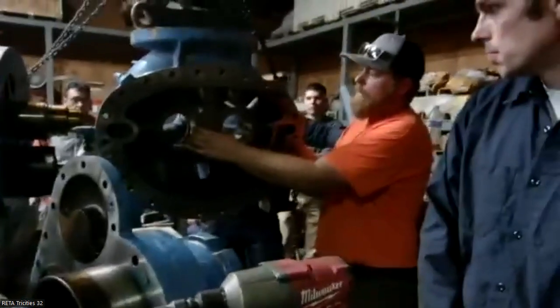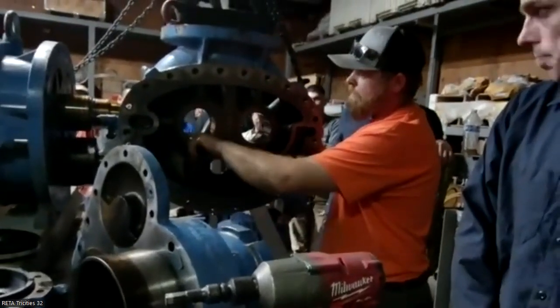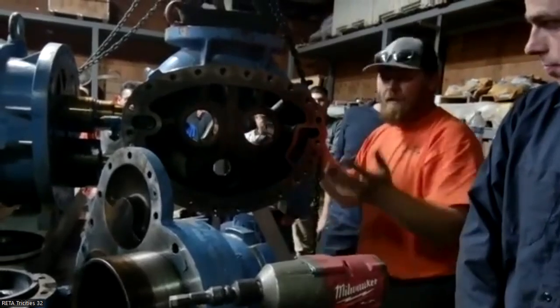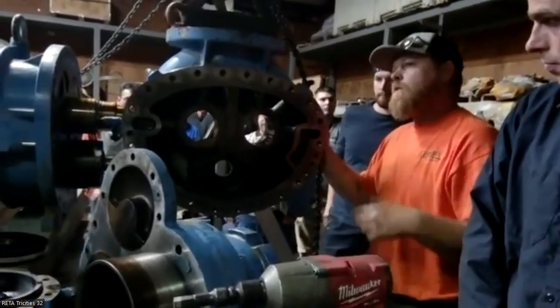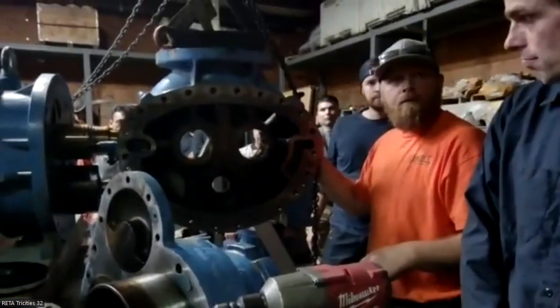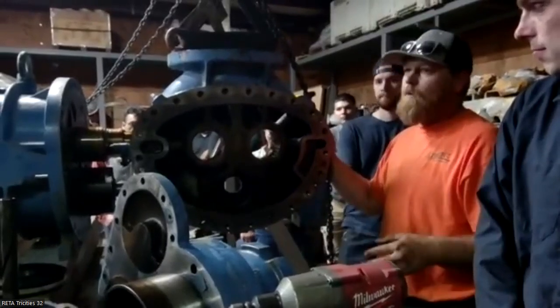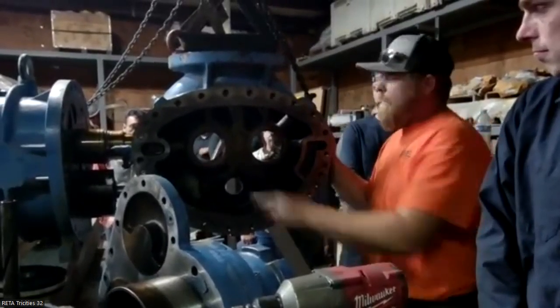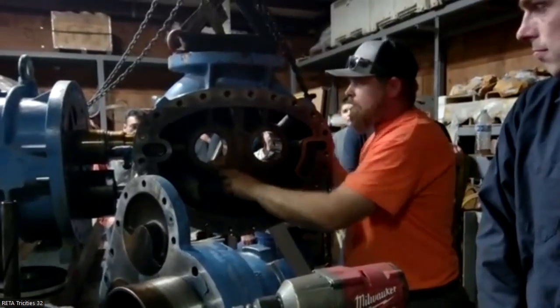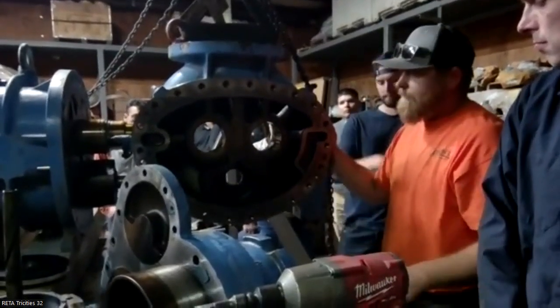These two sleeve bearings seal on O-rings, and oil's injected through here. That's where there are holes where it lubricates. That's why clean oil matters, because it's not a very big hole either. When you starve it for oil and it's not getting what it needs, that can be a result of that. As far as the varnish in here, that's not uncommon at all.